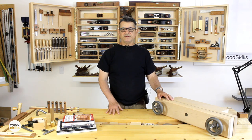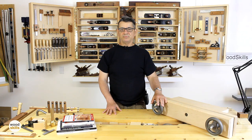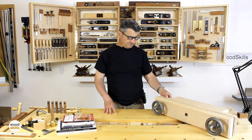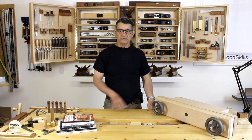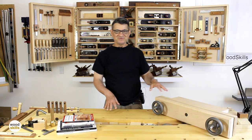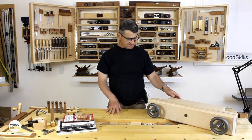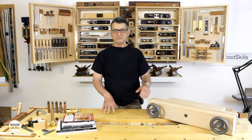Here is a brief description: a double screw vise held to a workbench top with clamps or hold fasts to facilitate certain work. This is a modified, my own design. Normally it has ears on the side that extend out, allowing it to be clamped to the workbench surface with F-clamps. I didn't like the aesthetic of that, so I redesigned it to incorporate the actual clamping within the Moxon Vise itself — a cleaner design clamped through the back.